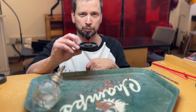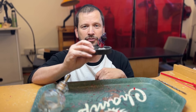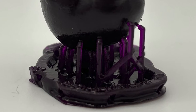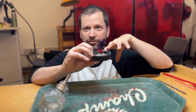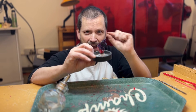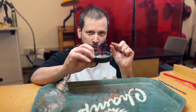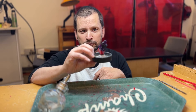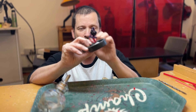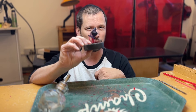Here's another piece with a more involved sprue system to give you an idea of different approaches. I'm testing not removing the supports from the 3D printing process. Based on how sprues work, the support systems are actually kind of the opposite — they neck in to make piece removal easier, which is a problem because that constrains metal flow through that opening. So I've added a lot of additional sprues around it to help the metal flow to different parts of the support base, and hopefully we'll get a fully cast piece.